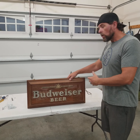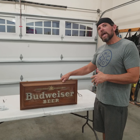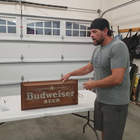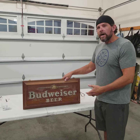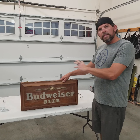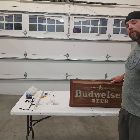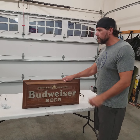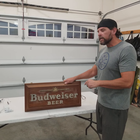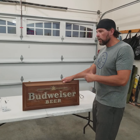Currently this sign does not work — it's old. I did a little research and found out it was built mid-50s, somewhere between 1956 and 1958. It's got a lot of old technology built into it. There's a fluorescent tube in here that's kind of hard to find, and all the components are the type of thing you might find or might not find. So we're going to gut this, get all that old technology out, go with some LED — kind of like what we did with the tub if you saw that episode — and make this thing look brand new again.